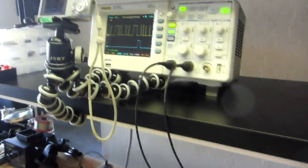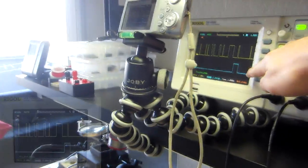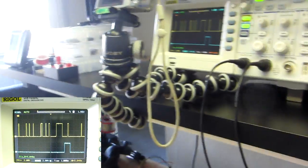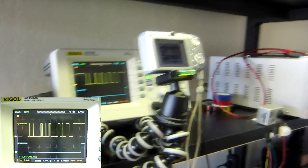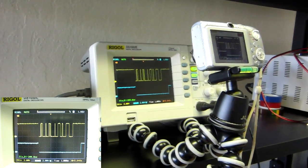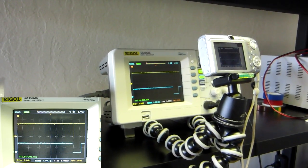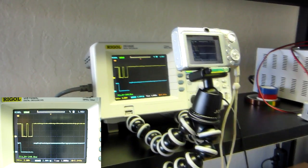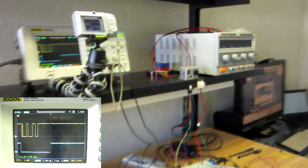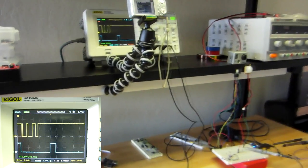The main difference is this one runs off of 12 volts while this one runs off 3.3 volts. I was able to modify this one to run off of 5 volts without a problem and I'll write about that. I have them both hooked up to the scope. The smaller sensor is the blue line, the larger sensor is the yellow line. They're both active low, so right now with no motion they're both high.